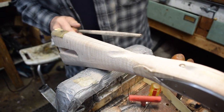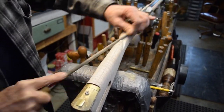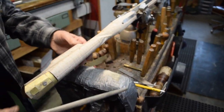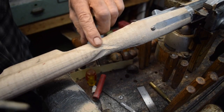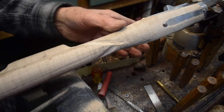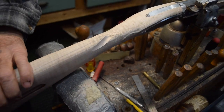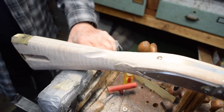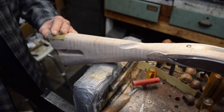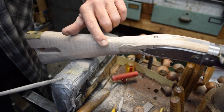Go right over to the other side and do exactly the same thing. If you look up on this side, we're bringing that down so that eventually this edge here just comes down and conforms with the cheek piece. When we take this wood off here, it'll look like it's swept down, so this big bump in here will have to be taken off. This happens very quickly. The butt plate went well this morning — a little over an hour — but when you have to get the video lined up it takes a little bit longer. Now I'm going to start taking this bump off in here.